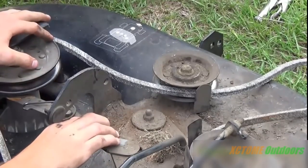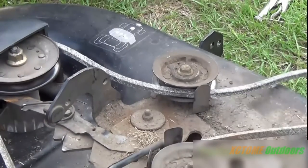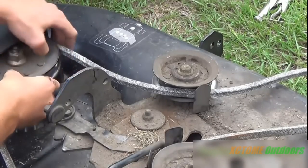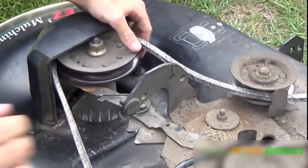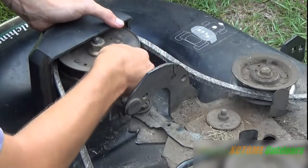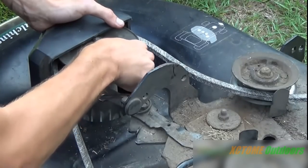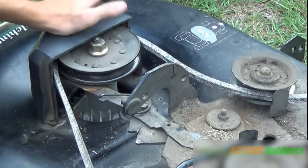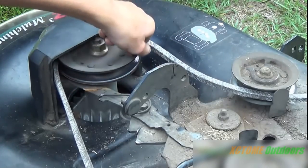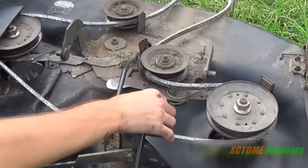I'm going to check the spindle bearings — I have a feeling about this. I'll go ahead and engage it. The spindle bearings are worn out. Listen to that. That spindle bearing is about to go, and that's causing the pulley to wobble when spinning very fast, causing it to cut into that brake band. Not good. But anyways, stick around and I'll see you in the next video.